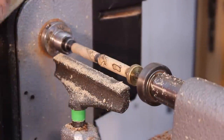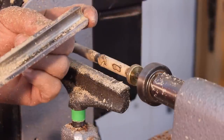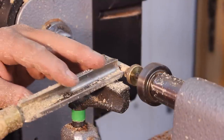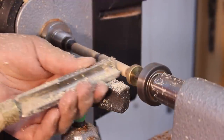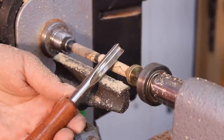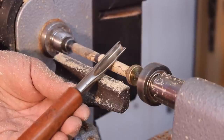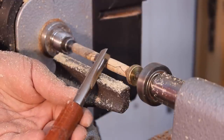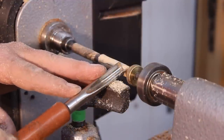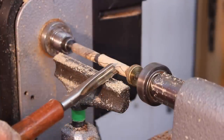As I get a little closer to my bushings, I'm going to turn this tool on its side and use that straight flat part of the flute right here to get a nice straight cut. Now I'm going to go to my Robert Sorby micro tool at this point. I've been using this on smaller projects like lidded boxes and that sort of thing, and it works really well. I thought this would be a great tool for turning pens, and it really is. So again, I'm going to turn this tool on its side and kind of work my way down to my bushings.